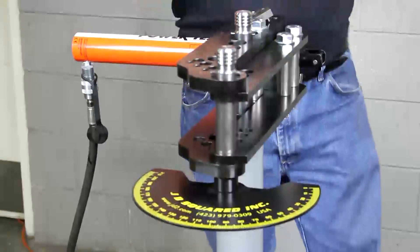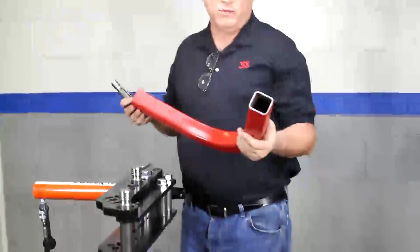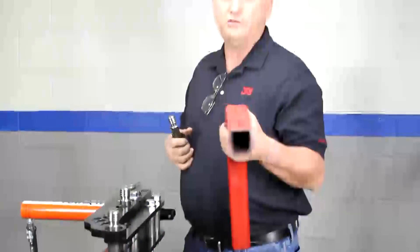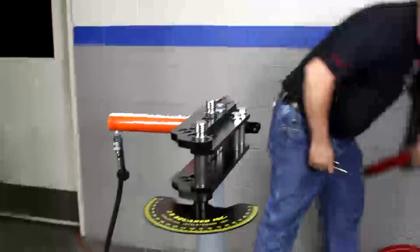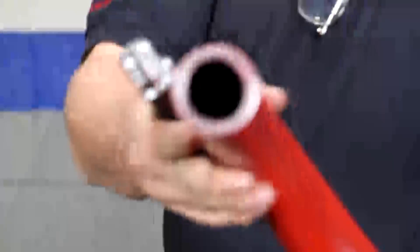She'll also handle two-inch square tubing — let's show you that. This is two-inch square tubing that we're bending with it, getting ready for a trade show. It's all nice and painted, 188 wall, no problem. We do not make tubing dies bigger than two inch, just for the fact that you can't get it out of the die — it wedges in so well. But the two-inch works extremely well. This is what two-inch, quarter-inch wall looks like — it's some pretty stout stuff.